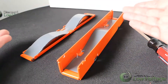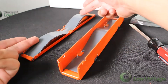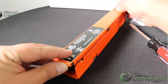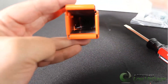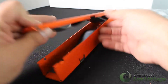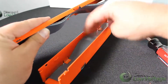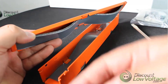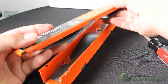The fire stop material is built in. You'll notice there's a bump here and two bumps there — that's designed so that when it's put together, there's no leakage going through in case of a fire or smoke, helping to seal it off. Once it's closed and in the wall, it's flexible, so you can add and remove cables whenever you want without having to remove the old fire stop and put new fire stop in. Sometimes people make mistakes and just don't put any back when they're supposed to.